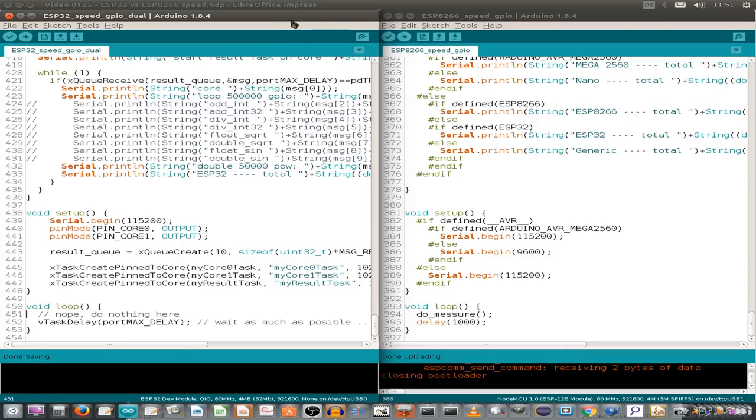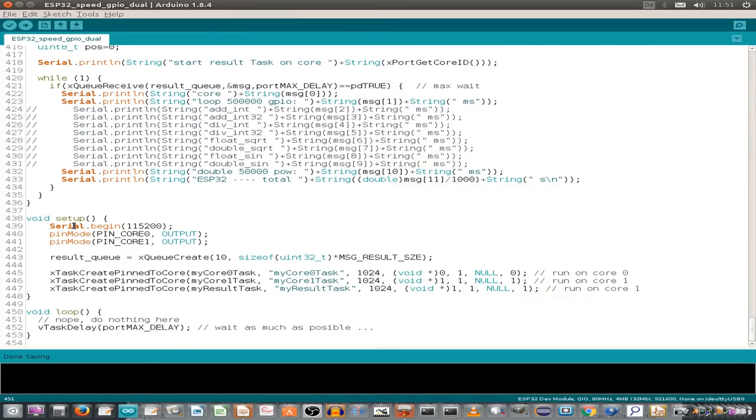ESP32, and we can make this a little bit bigger so you can see the difference. First we just initialize the serial interface and two different GPIO pins, so we can use different GPIO pins for different cores. Then, important for the messaging of the results, we create a message queue to publish the results of the measurements,